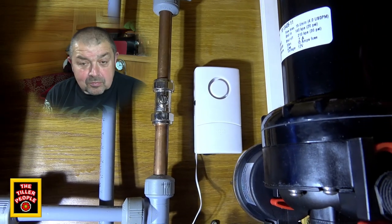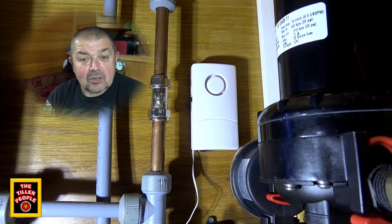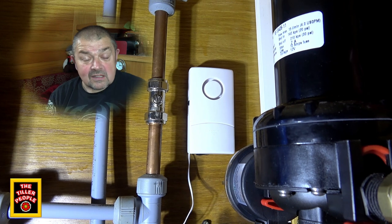If you get water under there and it's undetected, it causes rust and mould and things like that. And yet, there's easy solutions for it. Only a few pints of beer it costs. And it's just using water sensors. You just put them in position, put the wire and the sensor on the bottom of the boat in several places. We've got them in four places.